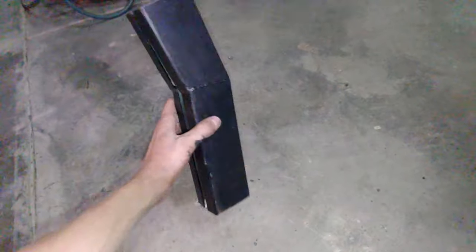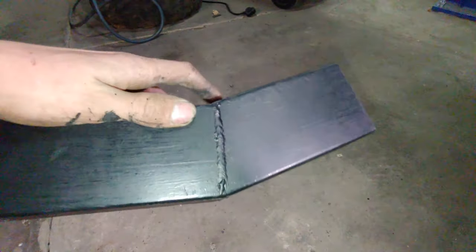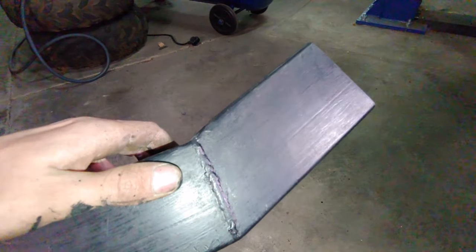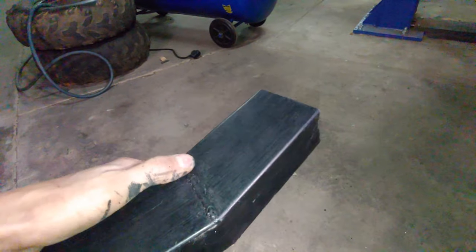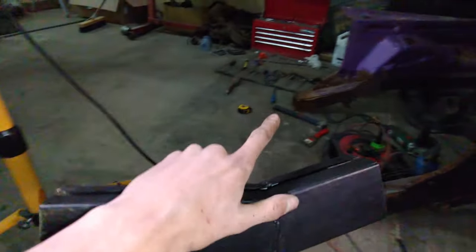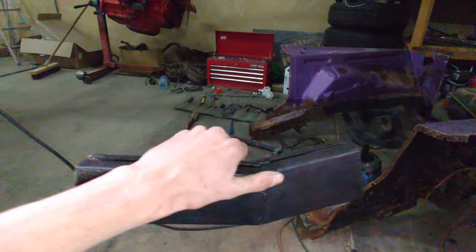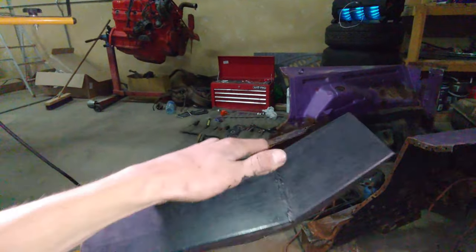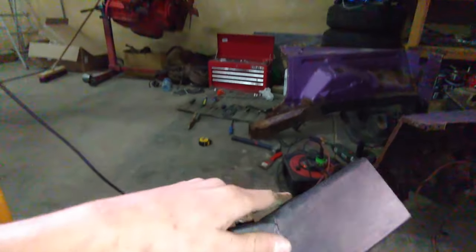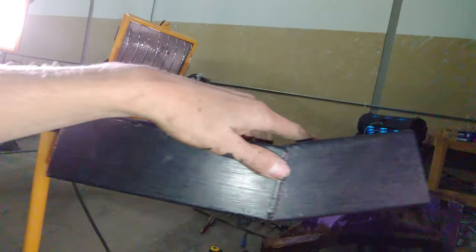And also, after that, I cut a notch into it, bent it and re-welded it. Now I'm not the best at welding, as you can see, but this is an acceptable bead of stick weld. Anyways, I did that, so this angle now matches that angle. So I can just insert it in there, spot weld a few sides here, throw a seam down there, and then it can just slide in and out with the whole thing attached.